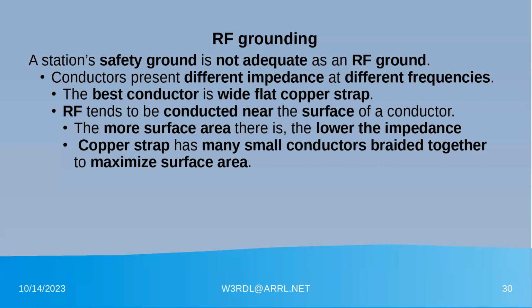Therefore, your antenna efficiency becomes a small percent. But you can do some magic with the conjugate matching of the impedances and actually change the effective ohmic or real resistance. Which is more magic. So, you can change the conjugate match, is that like capacitance? Yes, that's exactly what it is.